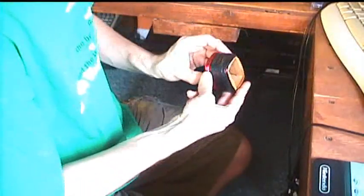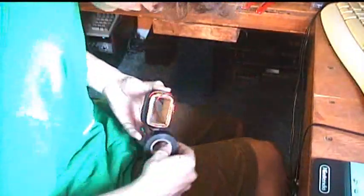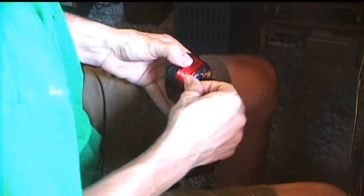Quite a time-consuming and careful process with quite a few annoyances on the way, when wire would spring out and not want to stay where it was wound and things like that. And then of course in the end it was a little too thick and I had to subtract some windings to even get the transformer metal plates to fit in. I know it's going to be... It's barely too thick, for Murphy's sake.